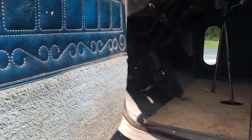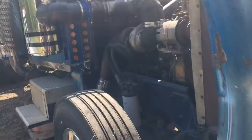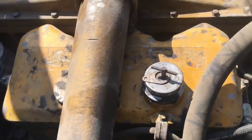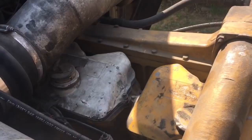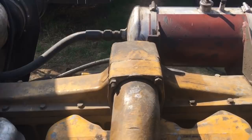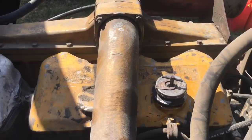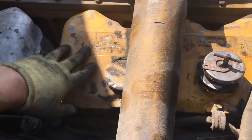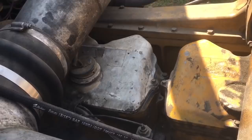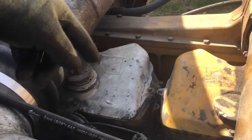I was talking with my cousin who owns an incredibly large farm and runs all kinds of equipment — he was actually the one that got me started in trucking and put it in my blood. I was driving an old Pete 359 just like this, a gray one. He mentioned he just re-did an engine on a Kenworth and it was about 30 grand for the platinum kit. This old mechanical block, if I did it myself with some help from a friend who's a heavy duty mechanic, I may be able to do it for 10 or 12 thousand — but hoping it doesn't need it. He did suggest I pull the valve covers off and take a direct look at how much slap is in the rockers, and look for any valve or lifter wear. I'll probably do another oil analysis to see if there's any material in there, but a direct look is going to be worthwhile. I've got the manual so I know all the specs. Just put that on the to-do list.